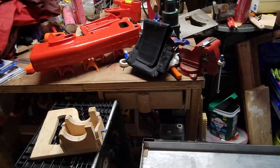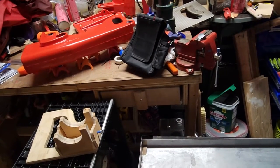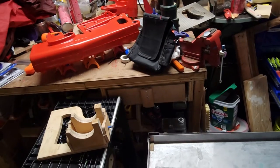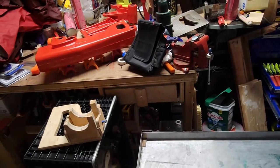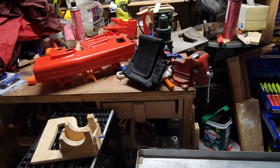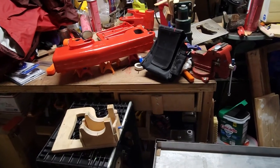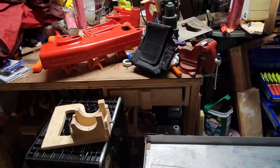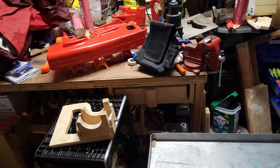But hand woodworking with hand planes and all that stuff, you need a very, very solid surface that doesn't move. In fact, when you build a workbench for hand woodworking, if you could have a concrete slab, that wouldn't be a bad thing. A concrete slab that weighed as much as your car would not be a bad work surface for woodworking. In fact, I'm really surprised I've never seen anybody do that.